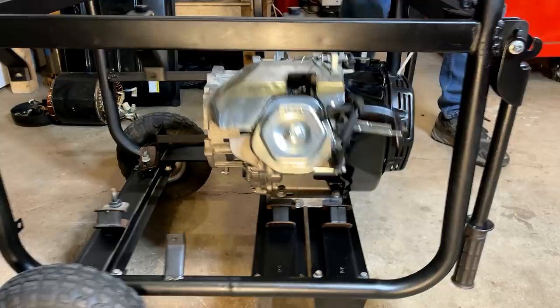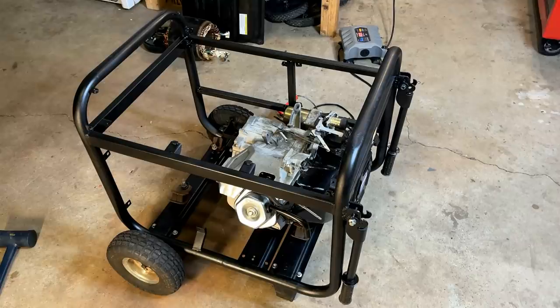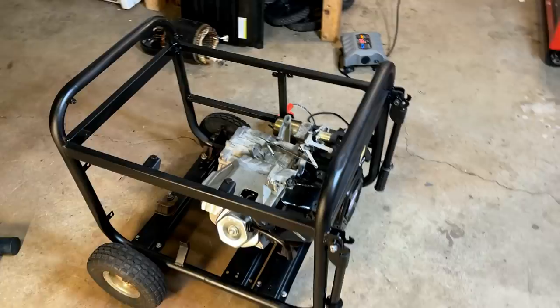Feels too high. Yeah, I just pulled this over by hand and the compression feels higher than it should be. I double checked the valve clearance. We're still pretty good. So there's really only two possibilities here. Either that rotator cap isn't the right part, or potentially there's something wrong with the compression release. Not really sure. Anyway, I've had bad experiences trying to start engines with high compression.